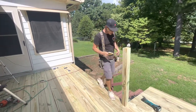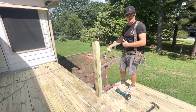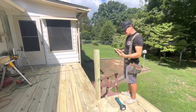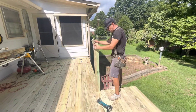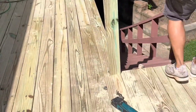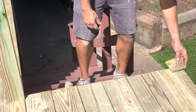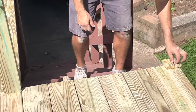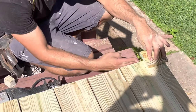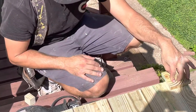When I look at this location on this corner, this is important because a lot of people want a gate right at the top of stairs leading up and down. So we've got to think about how we're going to finish this with a gate. In this situation, we're going to want this post right here on this side, and then we're going to want this post in line on this side. If this is our post hanging off of the deck, we have to create a notch in the post.